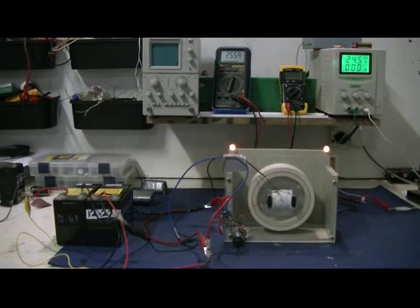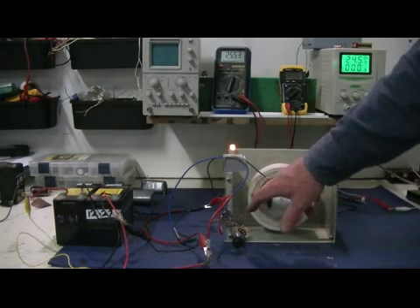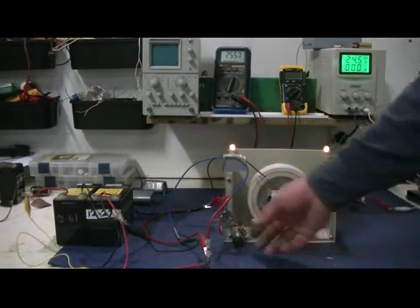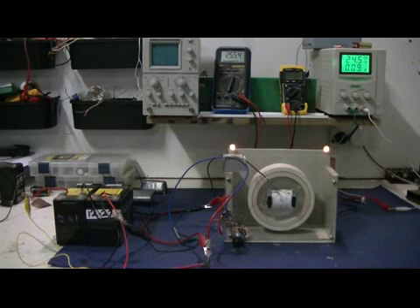As you can see, it's turned out quite well. Having the coil in the middle and firing on both magnets definitely has made a major improvement to the output power of the shaft to drive a generator, and also a big improvement to the battery charging side of things. So it'll work quite fine on 12 volts as well.